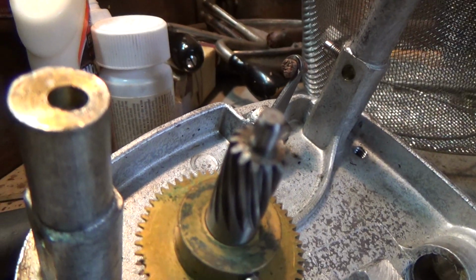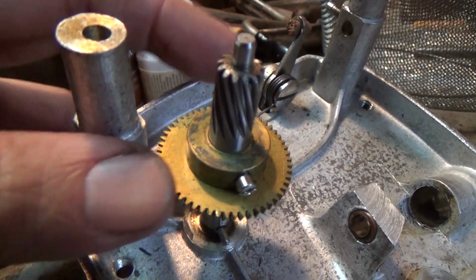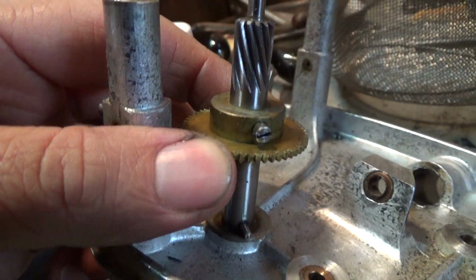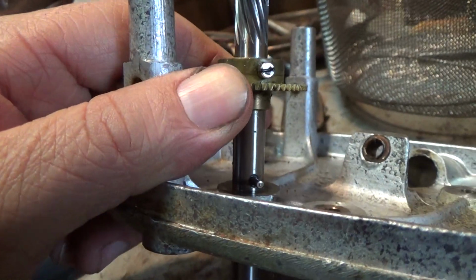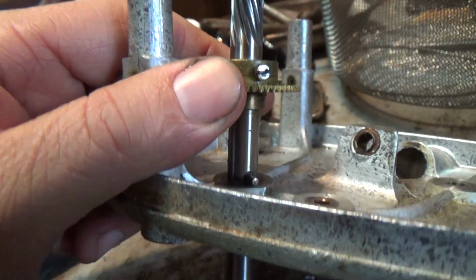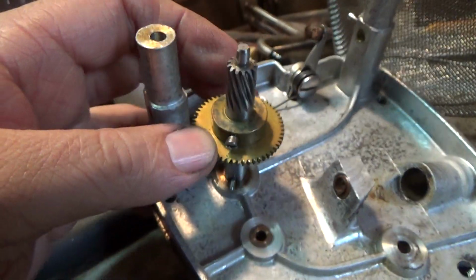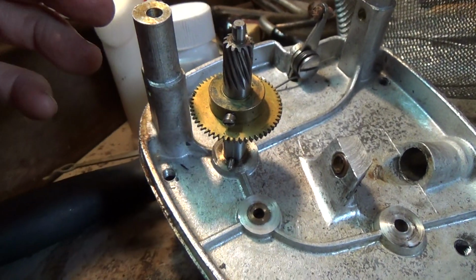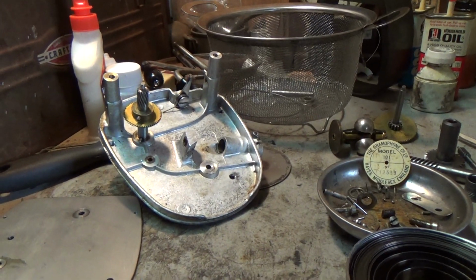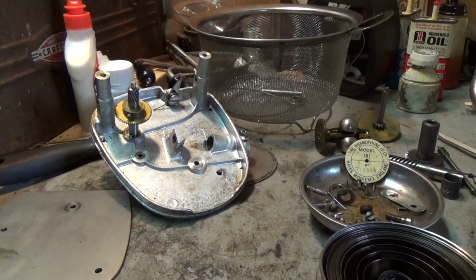It goes right on the end of that shaft. And this shaft, that's why I put it on there, has movement. It goes up and down. So you don't want it like that. It has to have a ball bearing to keep it a little bit off the bottom. Nothing, even your gear's not going to line up right. It's got to be there. So if it's missing, and that motor it was, my last HMV I did, it was missing, you do have to replace it.